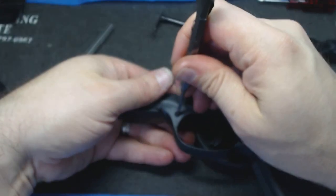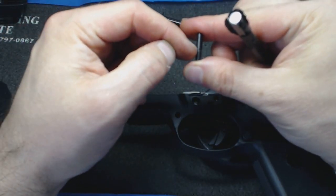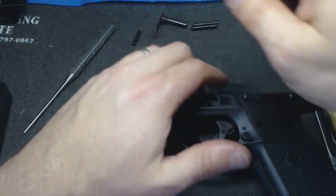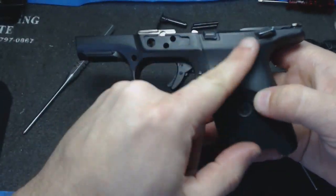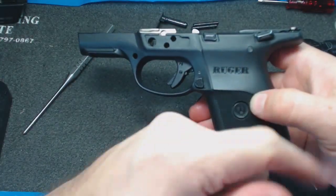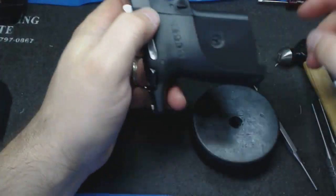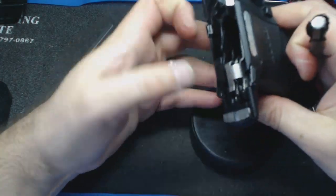And this little guy here, it also has a retaining groove, but it's just retained by a rubber O-ring. But again, it's offset to the left, and we'll see that when we pull it out. Now this pin, if you look really carefully, you'll notice it's not round. It has one side that's filed flat, and that means it has a very specific orientation. And if you tried to push on it from the other side, it wouldn't go anywhere.